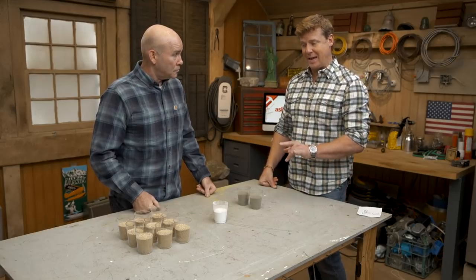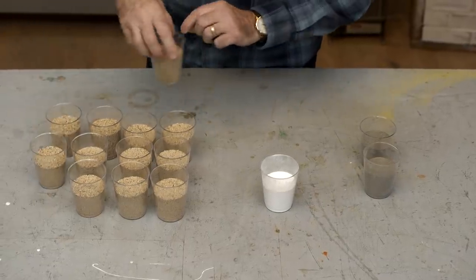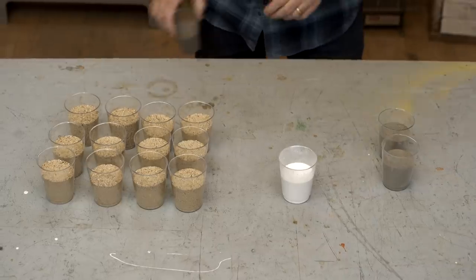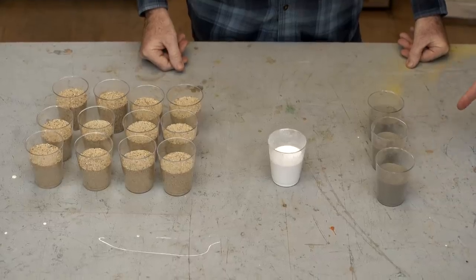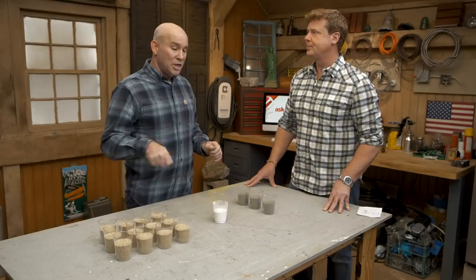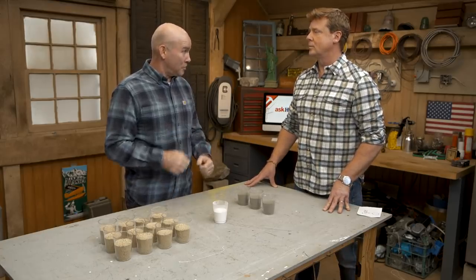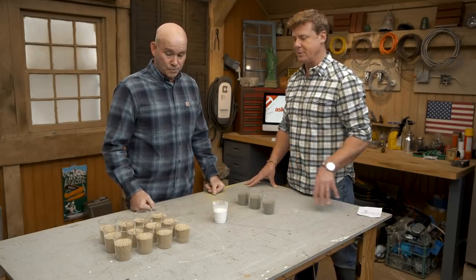After O, N, and S, our strongest is going to be Type M — M as in Mary. You add back some sand and another Portland cement — triple the Portland of our O and N — but no additional lime. This maxes out around 2,500 PSI. It's not what we lay brick with because it's too hard to use and very rigid. You'd use this underground or anything close to water — think of a block foundation. Use Type M to build up the block and you'll have a nice, strong foundation. Know the formula, know the recipe.